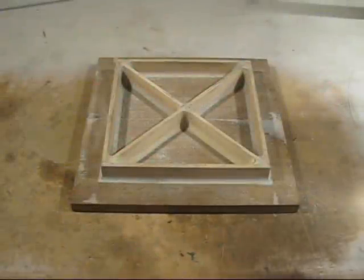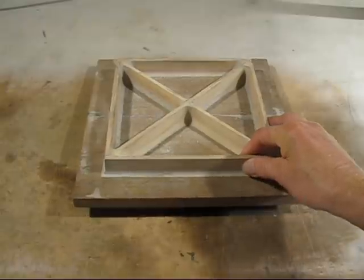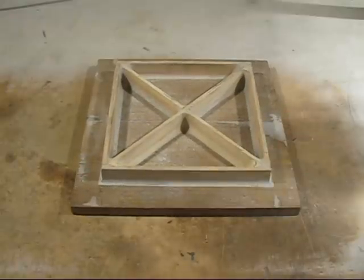Today's video is all about melting a lathe. Now why I'm using it is, there's two reasons. One, the bed weighs 33 kilograms, so it'll last quite a few melts, but also at each melt I'll know exactly what I'm getting. And the second reason is, I'm desperately short of small pieces of cast iron that will fit in the crucible. So the guinea pig for this trial for the lathe melting, I'm using the pattern for a surface plate, and we'll see how that goes.